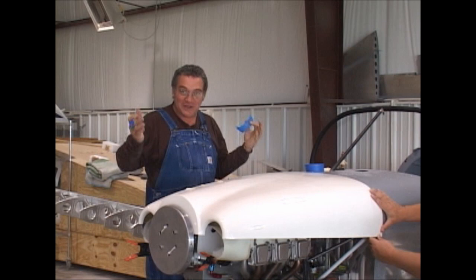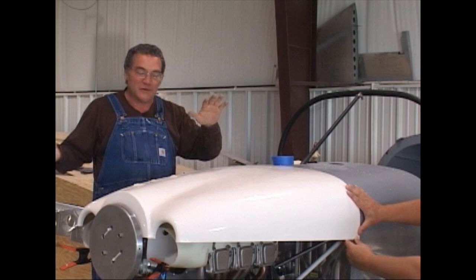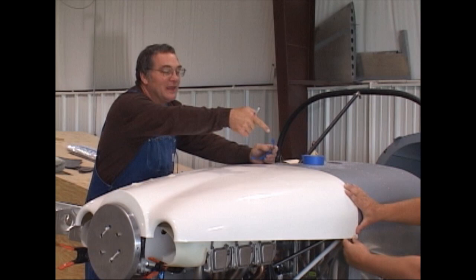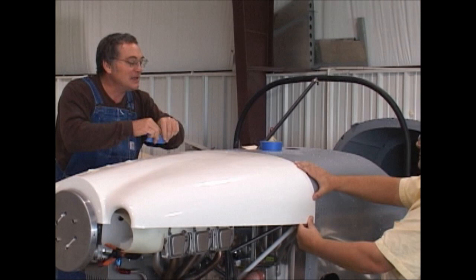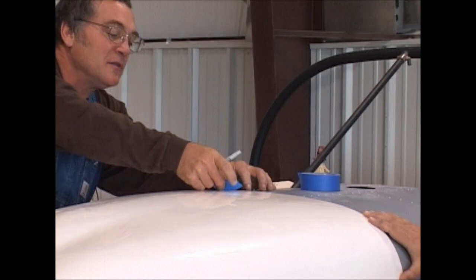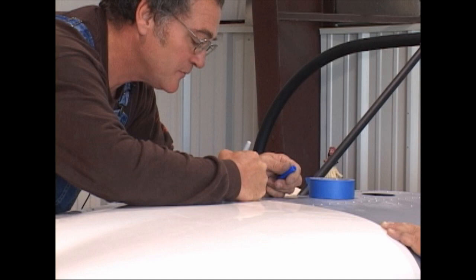What we want to do first of all is make sure that as we fit the cowling, we put it back in the same position every time. So I want to establish a centerline mark at the top of the cowling to make sure that as we remove it, we get back in the same place every time. The lower edge is at the same position on both sides of the airplane, and we referenced the rivets that are already installed in the airplane to do that. I'll take a piece of tape and mark a line on the fuselage and on the top of the cowling so I can always reference back to the exact same position when I reinstall the cowling for subsequent fittings.